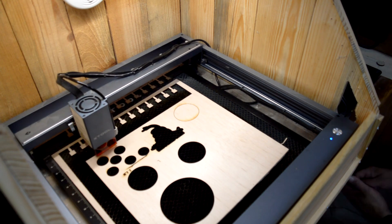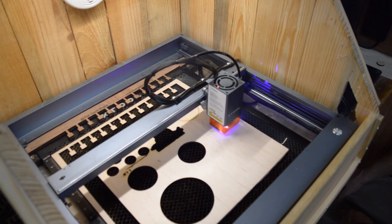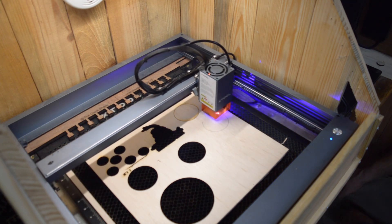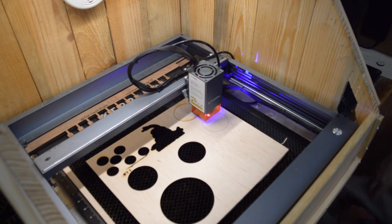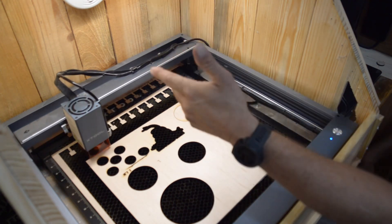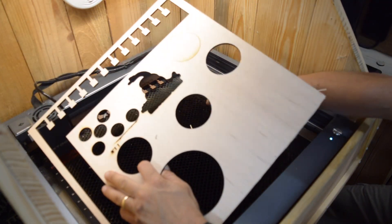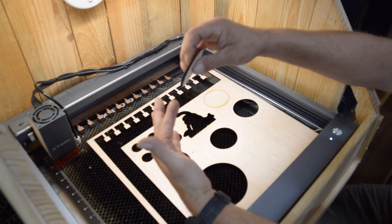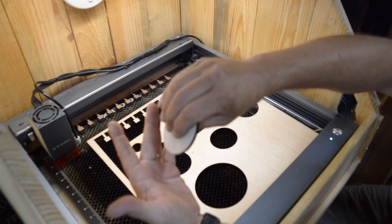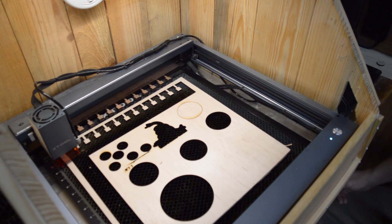You can see it obviously makes a difference — there's no scorching around that hole, it's nice and clean. It's definitely working just as well as the X-Tool air assist I've been using. You can hear my air compressor just kicked on — it should have no problem providing this little bit of air. With the door open I triggered an alarm, so smoke is coming up instead of going into the vacuum. That's a clean dropout — very little soot on the cut.